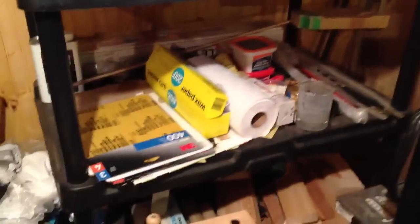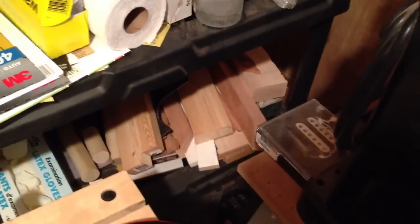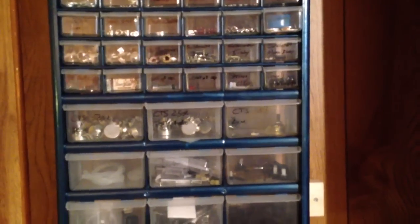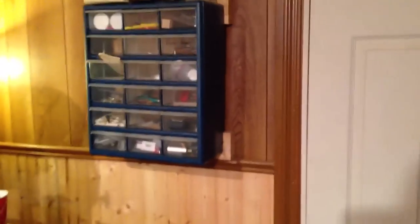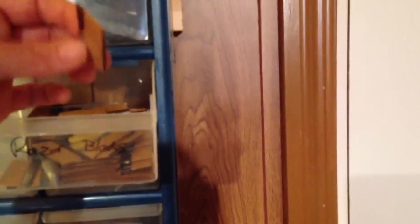I have a lot of tools. Sandpaper galore, because you need so much sandpaper when you're doing frets, finishing, and prepping. I've got a couple of truss rods over there and some leftover wood I use for making jigs or shimming — general use. I don't throw it out because I know I'll use it. Buffing compound. Oh yeah, table saw — I've got one of those. And a few things in stock: all my electronic stuff, anything from 500k, 250k, 100k pots, jacks, springs, switches, knobs, and all sorts of screws. A tip: don't buy screws or fasteners from a music store — they charge you a fortune. Go to Fastenal, give them the one you want, and they'll get you a bag of 100 for $10 instead of paying $15 for 12 at a music store. Razor blades — you become a real tool nerd when you're in a shop. I always have three or four razor blades; very useful.